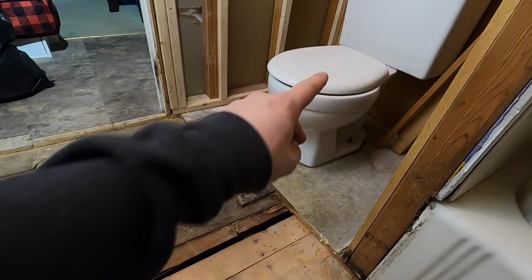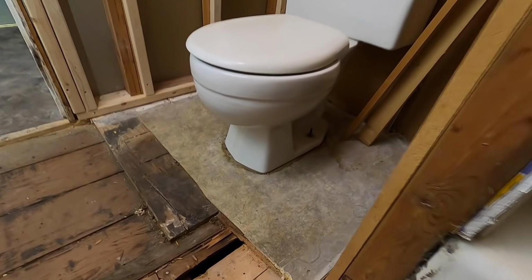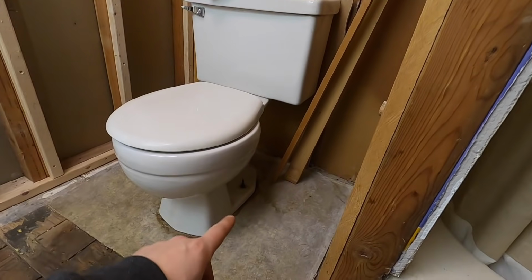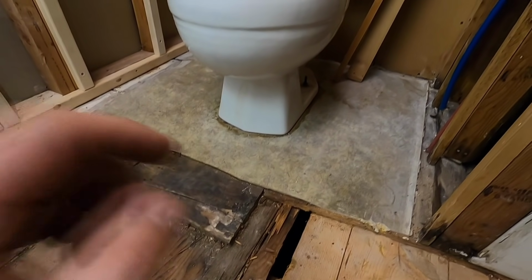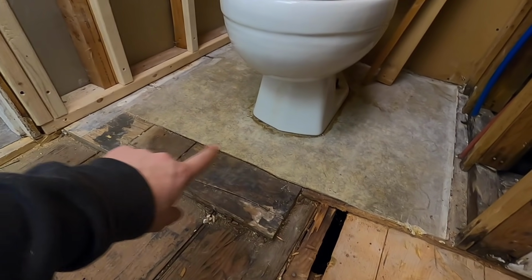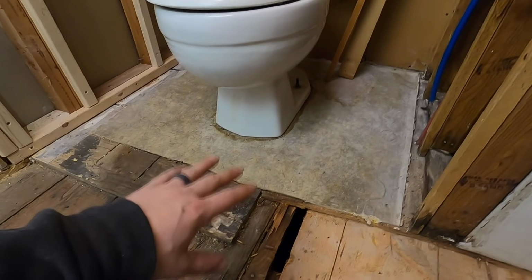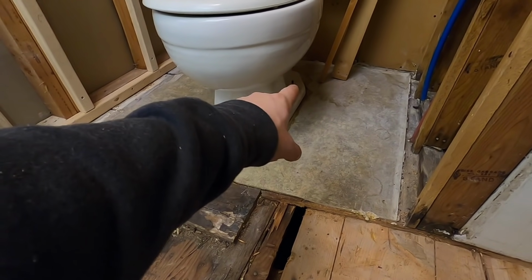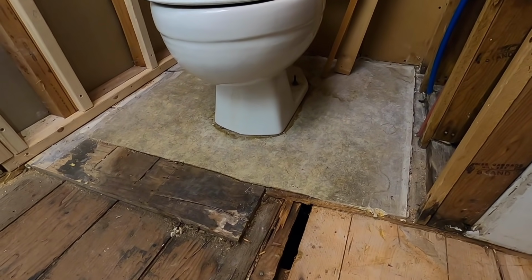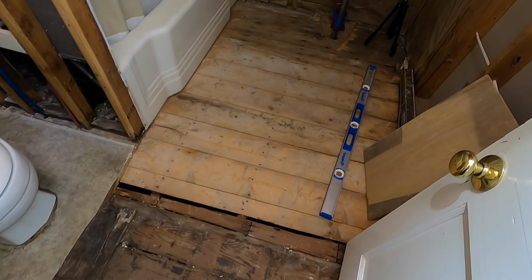But so when we go to do the toilet, that's probably the first place I'm going to do this. I'll have the plumber come in. He'll take that out right away. And then I'll take out the sheetrock that's behind the toilet, or drywall. I keep saying sheetrock and drywall. It's basically the same thing. I think drywall is the proper term. But then I'll take all this floor out, do my pieces, fill it in with thinset, put the backer down and screw it in. And then I can walk on it. I can do whatever while it dries. But then I think he can use tile pieces to kind of put his flange where it needs to be, and then we can shim the toilet temporarily until I do the tile here. So, yeah. A lot of work, but gonna totally be worth it.